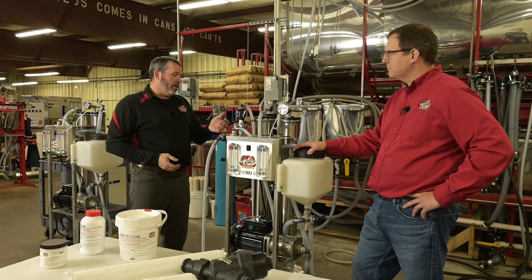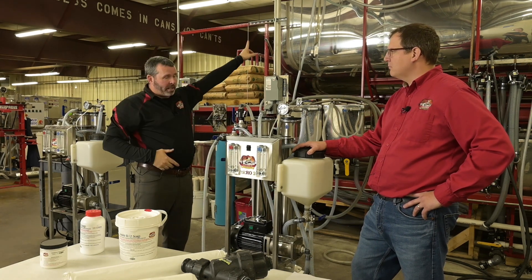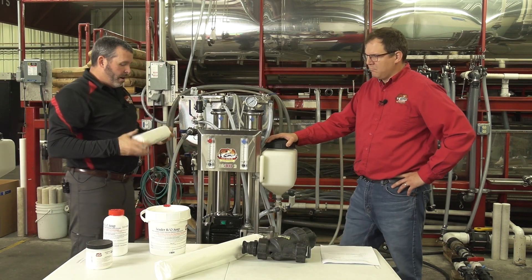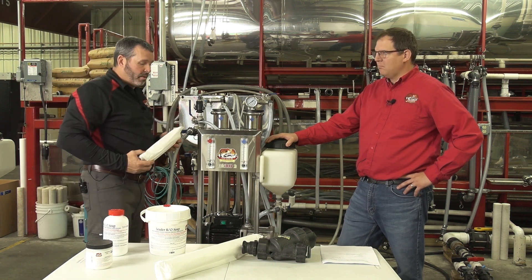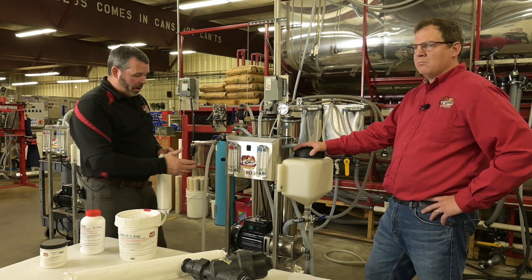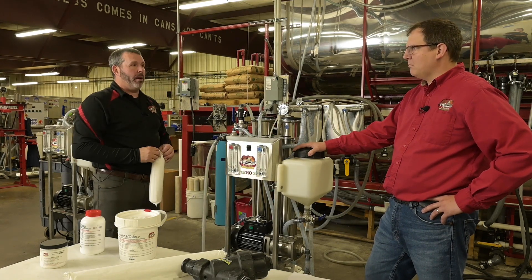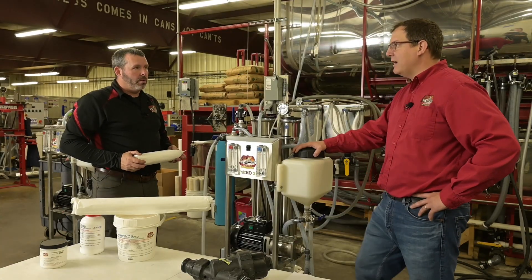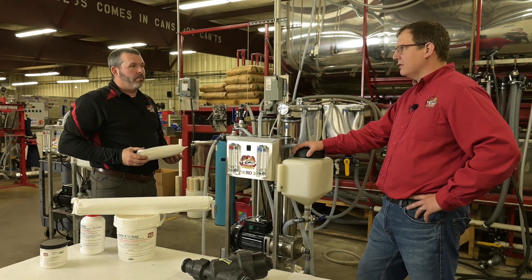The permeate outgoing and the concentrate outgoing — I like to have those over the top and have my hoses running up to the back to my tanks. So tell me about these filters here. These are our filters — 10 micron filters. We have tens and we have twenties. These are very important. They go into the cartridge filter housing on the machine, and that stops any small particles from getting to your membrane. Some of the bigger machines have 20-inch filters — the bigger machines have multiple. As far as starting up and getting going, you're going to want to make sure you have plenty of those available.